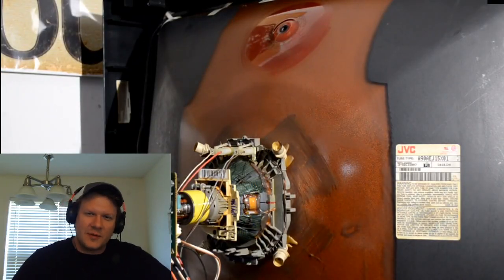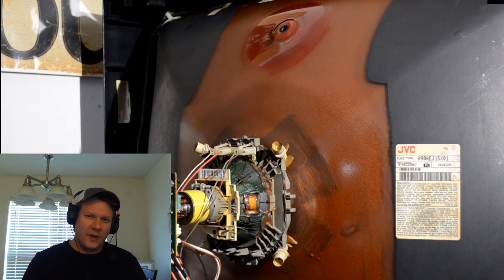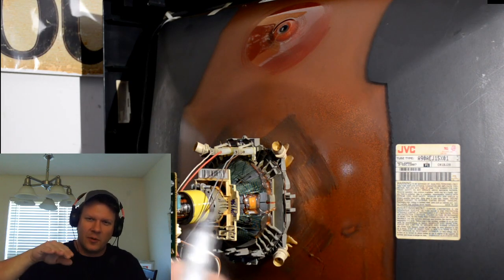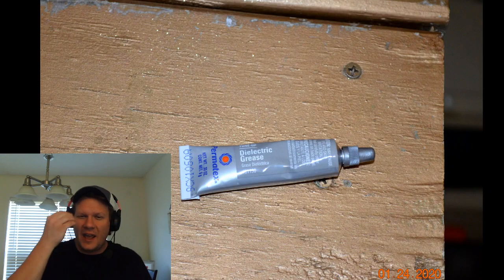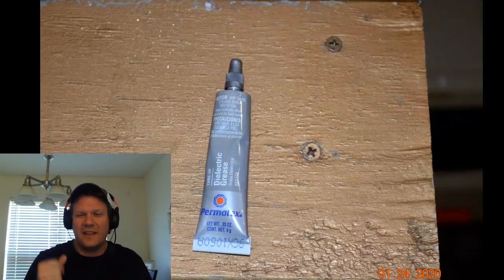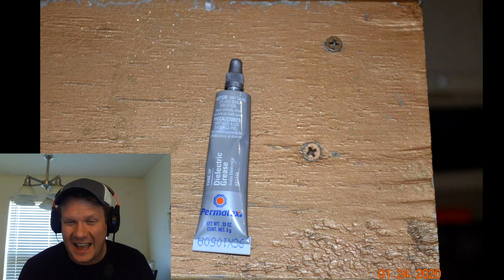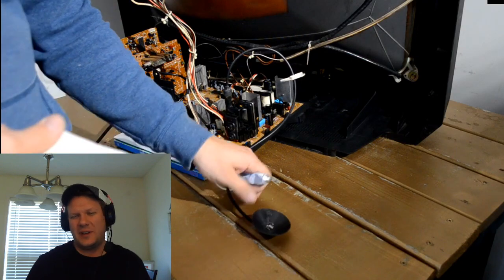So the last thing I did was I cleaned off that connection point on the back of my television with some alcohol. I didn't record that part, but I did just take a little wipe and put some alcohol in there because I wanted to get rid of all that residue, and I reapplied some new dielectric grease. This is what I bought. It's available online. It's called Permatex is the brand, and it was about $10 for this tube, which is plenty,